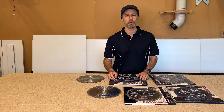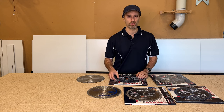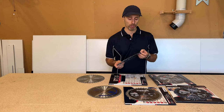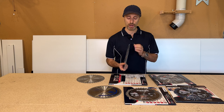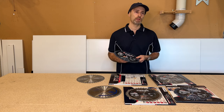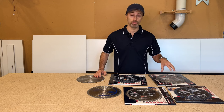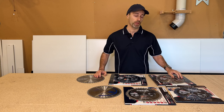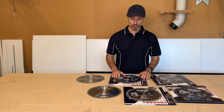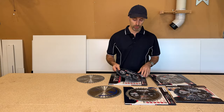For me in Australia ordering online from America, you're looking at around $140 to $150 Australian for these blades, which isn't too bad considering you get a quality blade that'll last years. The teeth have got a lot of meat on them and you can get away with sharpening them multiple times. I remember the first time I took my melamine blade to be sharpened, the guy told me straight away these are really good blades and you'll get really good life out of them. So I use the 60-tooth just for trenching here and there.